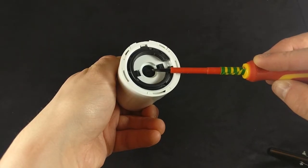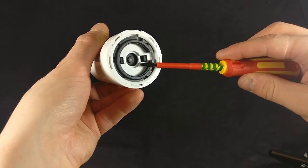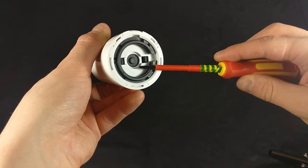If you look at the underneath of the valve, you'll see that there's a servo motor. This is very different to a piece of wax that works in a normal thermostatic radiator valve, a manual one that you might be used to. The Genius Radiator Valve has a thousand steps between open and closed. It has a digital thermometer inside which measures the temperature of the air and also the temperature of the water going into the radiator — making it very, very accurate at controlling the temperature of your room.